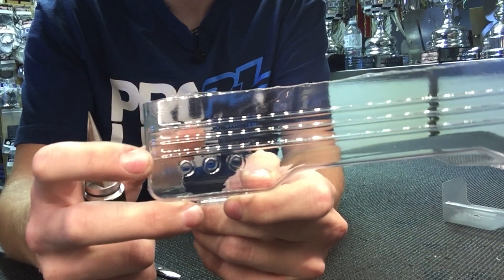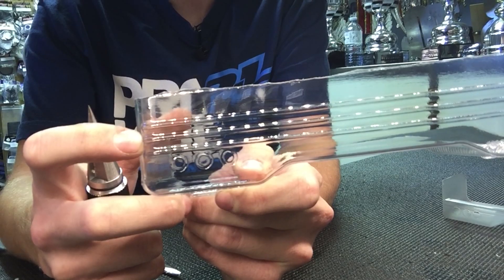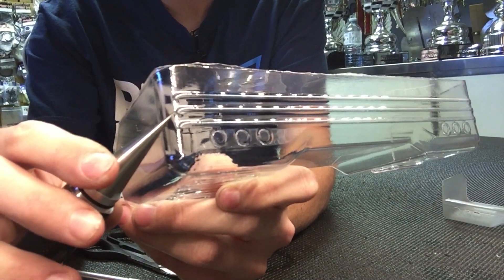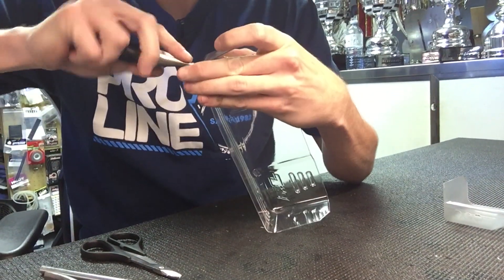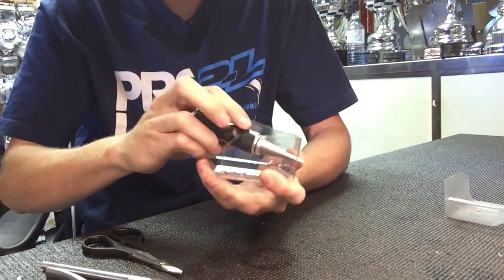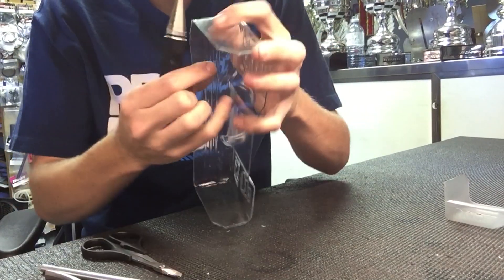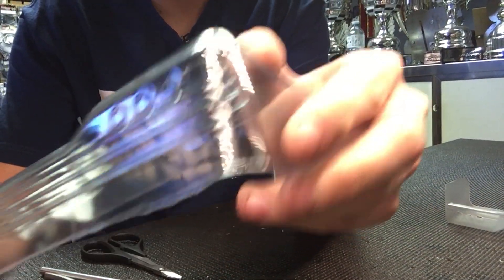Since I'm folding on the second line and leaving the first line, I'll drill a hole right on the corner, right where that edge is — right about where I mark it. I'll start drilling a hole right at the edge of that second line using a body reamer. I do that on both sides.